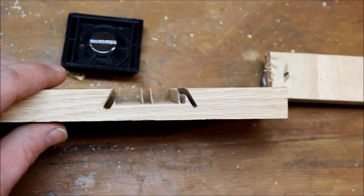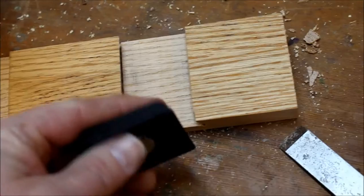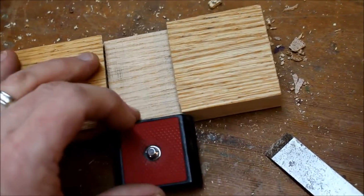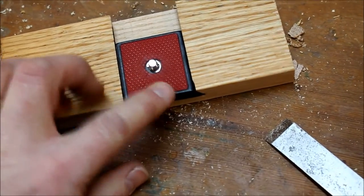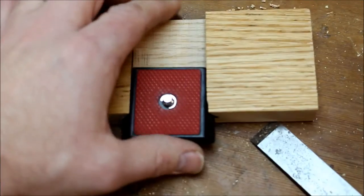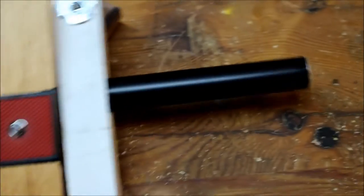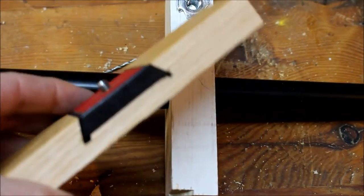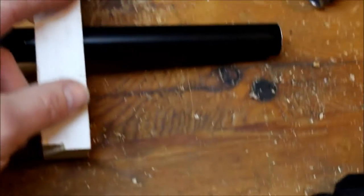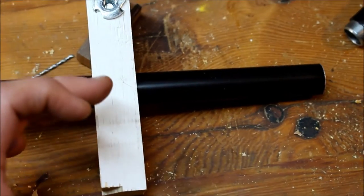I got the angle cut with the radial arm saw. I'm just going to clean it up now with the chisel and see how it fits. It's a nice resistance fit, so I think I can slide that in there, and then the idea is that this is going to mount to this piece. I'll have to trim this off the side, cut this down, and then also cut it on either end, and then mount it to this piece right here. It's going to sit right there — I'll be able to slide this in and mount the camera right there.